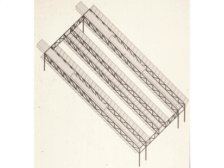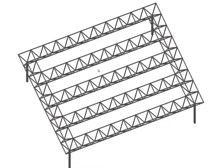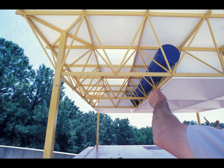However, a flat ceiling in that configuration can feel a little dark and gloomy. What we can do instead is take two of these trusses, slope them, and create a tubular truss down the center line. In this example we've made both the girders and the joists into tubular trusses, and this is an example of how that would look.